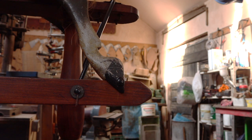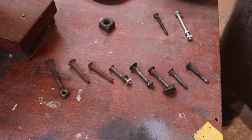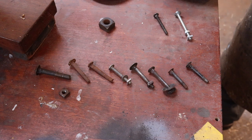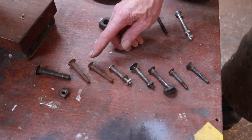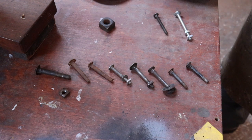Modern bolts are metric, and these old bolts are what is known as a Whitworth thread, which were relevant from the middle of the 1800s up until maybe just before or just after the Second World War. Nowadays everything is metric, and to my way of thinking, not very nice. I'm going to briefly explain a little bit about these coach bolts. They've been around a long time, but initially they were made by maybe a blacksmith or individual companies and would have been all different. It wasn't until about 1840 when things became standardized and they used a specific thread — the BSW thread.